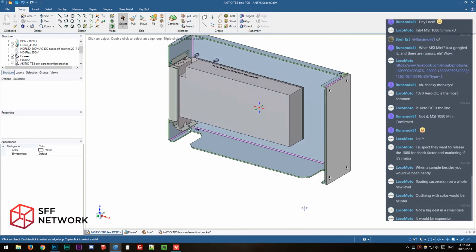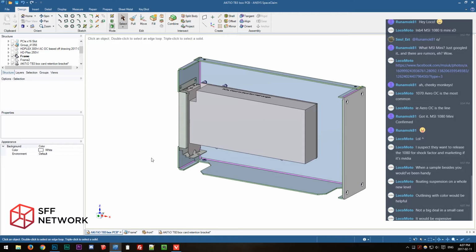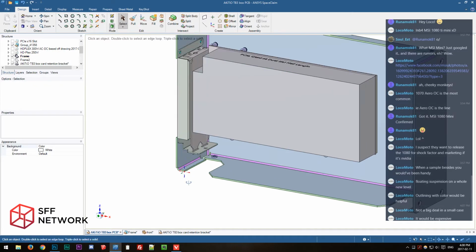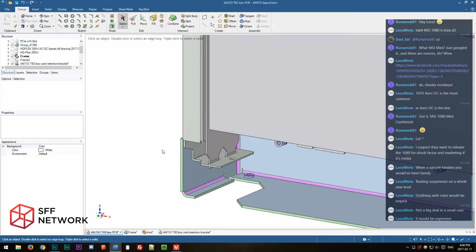And I guess this is true of manufacturing in general, that the more parts, the more expensive. Because some people talk about how having one washer or grommet or something is a trivial expense. But the thing is, it may not be very much of an expense, but it is an expense. It doesn't literally cost nothing. So every little part and detail adds more cost, which, we're not mass producing these things, so it's not a huge deal if it adds like $2 or whatever. But it is like the less parts, the less expensive. So generally that's how you want to optimize sheet metal.